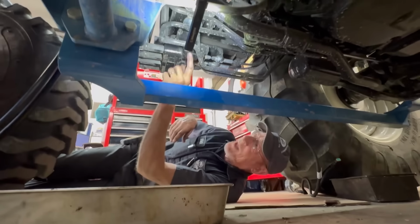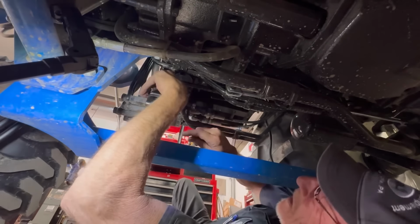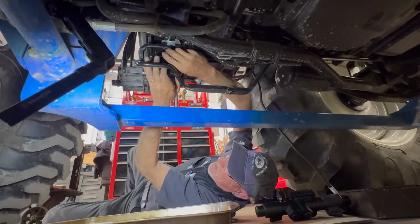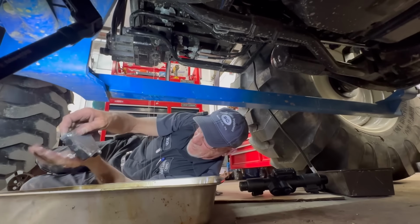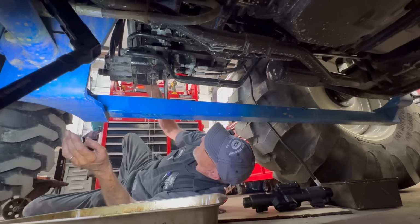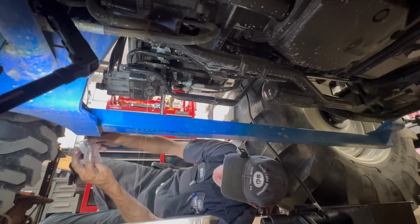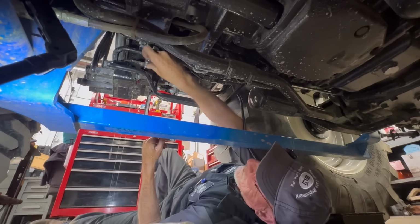So we're going to take this plate off for your expandable valve. That's just a blanking plate here. That's the one I showed you earlier. Now there's an O-ring groove cut in all of these ports, so you want to make sure those O-rings are still there. I'm going to put this spool in here. Again, it's going to go with the threads out. I'll put that in that large port.